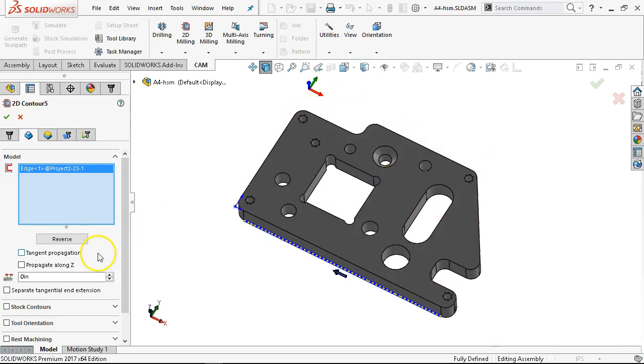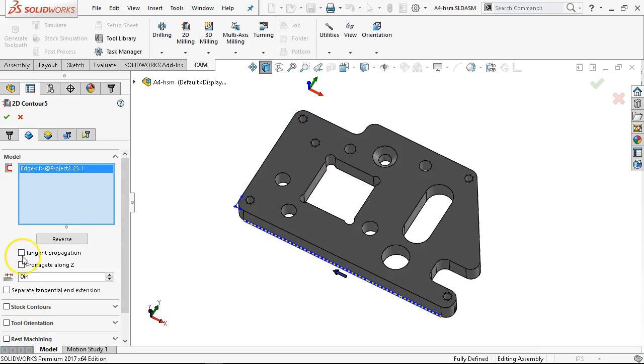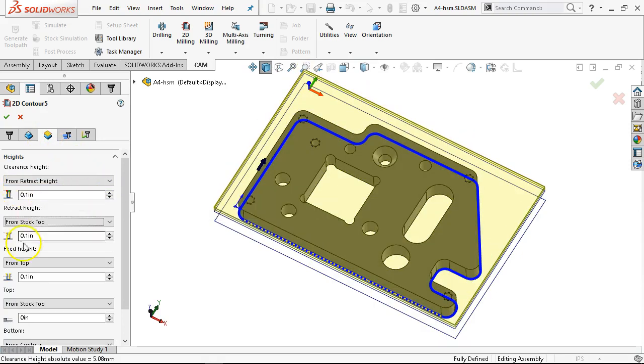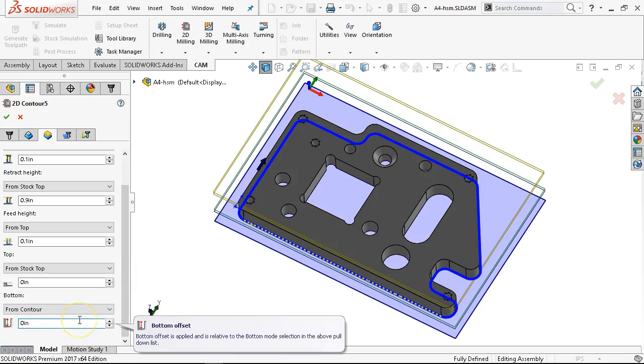Maybe along this edge we'd do another force tool change stop, switch the clamps over, and basically we're grabbing on the outside. For expediency here we're going to run around the entire part. Stay with my clearance for the clamp — 0.9, 0.1 — we'll go minus five thousandths.